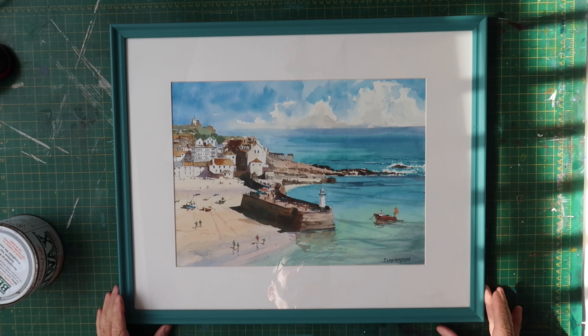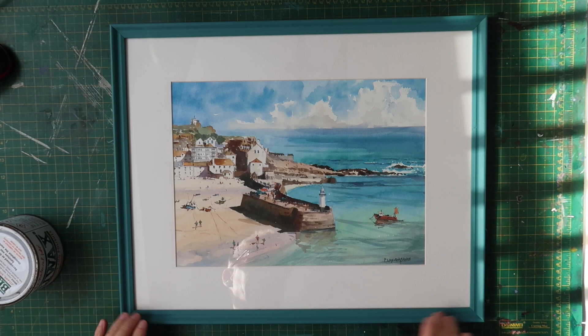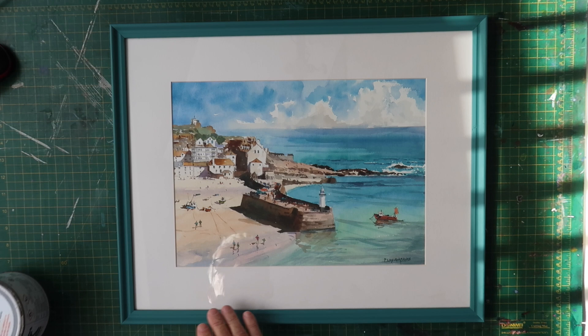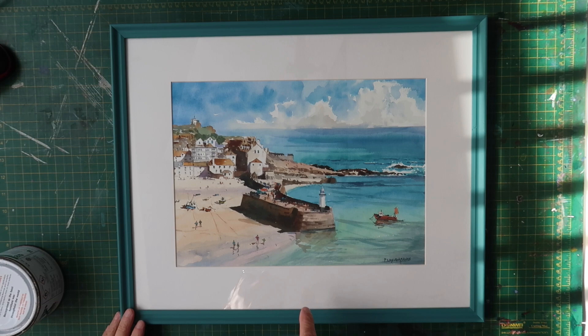That's after three coats of eggshell paint, waiting for it to dry between coats obviously, and it all came up beautiful — the finish is lovely, really lovely. I then gave it a coat of bright wax which protects it and adds a slight sheen, takes the matte away — not a lot, not a very high shine, just a slight sheen. There are a few pictures following to show you it from different angles.